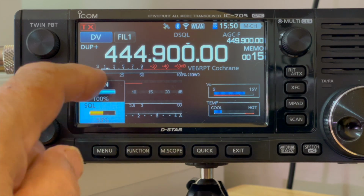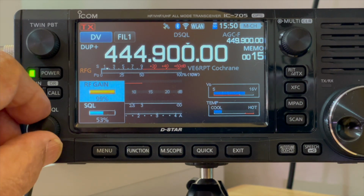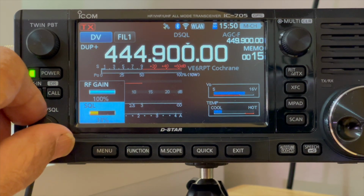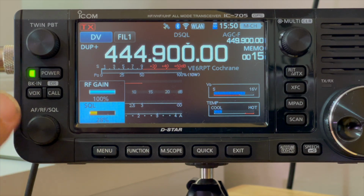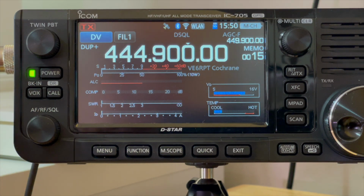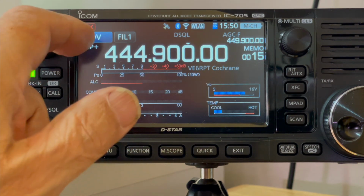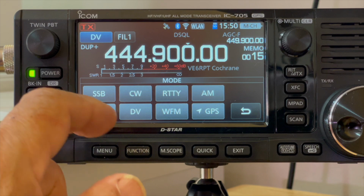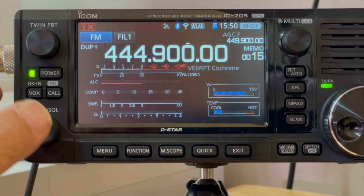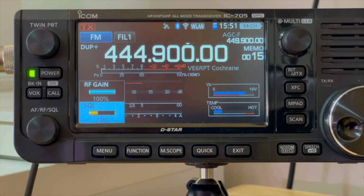then I have to select if I want. Oops, I took too long. Then I can adjust the gain, or I can adjust the squelch. Okay, and let that go out. And now I can turn up the volume. Okay, hit the squelch. Notice how there's no squelch noise. If I go to FM, there you hear the noise. There, around 30, 31 turns it off.